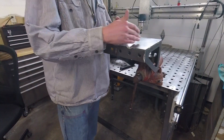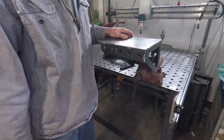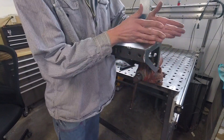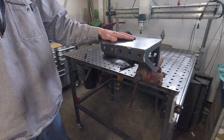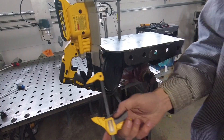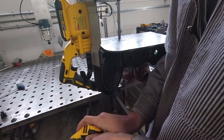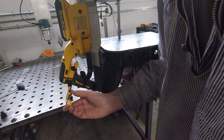You can mount any bench vise in this direction as long as the jaws are five and a half inches or less. If you had a bigger vise with a deep throat, you could put it in the vise in this direction as well. I think that's what I'm going to do with it — that way the saw can follow me around closer to where I'm working. This is my preferred method of activating the trigger, and with it being a variable speed trigger, you can adjust your speed using this clamp-type clamp as well.